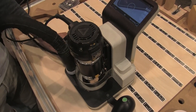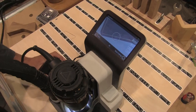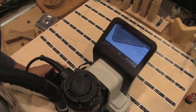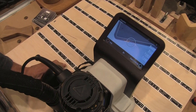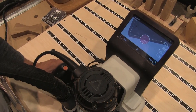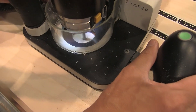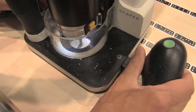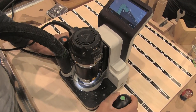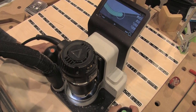With that I'm ready to cut, so I'll just dive in. I'm going to put on my safety glasses and turn on the router. I've got my cut depth set to a quarter inch. The only thing you really need to know is that I'm operating a big circle — as long as that big circle is anywhere on this line, the router itself will compensate to make the cut. I'm now plunged into the wood with a conventional cut. If I hold down the auto button on my right thumb, it will auto-complete anything within the corrective range.